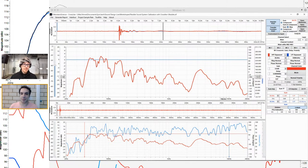We have these tools to make better decisions. Without applying noise reduction to remove the room, maybe it's really difficult to see just the system or to identify if we need to change something in the room, something in the microphone position, or something in our system. So that's why it's really important to have all these tools in automatic way or also manual. An advanced user will make better decisions and will have better results from the system, from the room, from everything, applying all these tools separately.